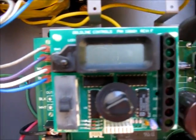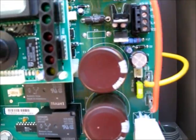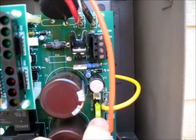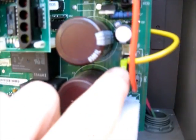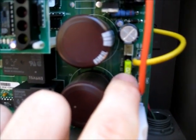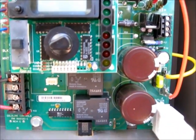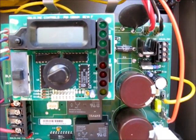Before I do that, I'm going to snap some still pictures. Everything's pretty well labeled, but I want to make sure I get it back in place correctly. The third thing it could be is this mini fuse right here, and I bought some replacements. So I'll probably first try to replace this and see what happens, then take the board off and look at the K1 as well as the current limiter. I've never soldered before, so this will be a first attempt.